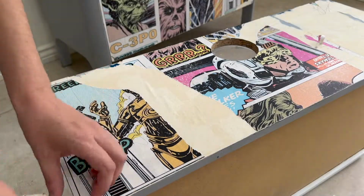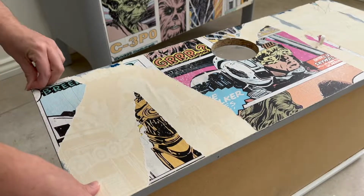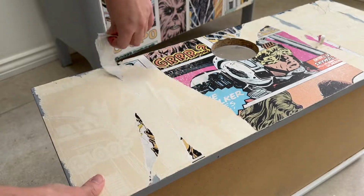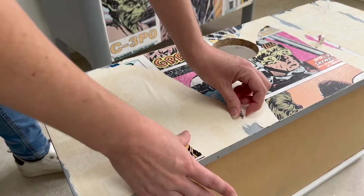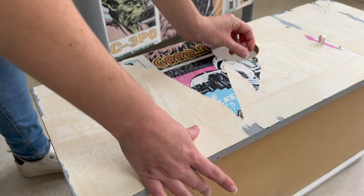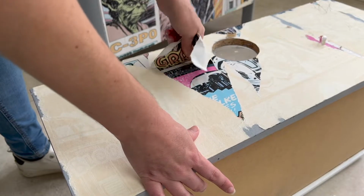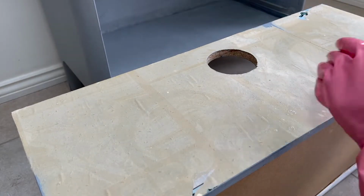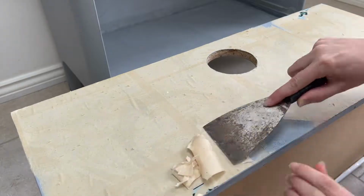Fortunately, the piece didn't need too much of a clean to make it suitable to start from, but I did need to remove the wallpaper properly so I could start with a clean slate on those laminate drawers. The top part of the wallpaper peeled off quite easily. That's the piece with the image printed on it, and it just left that bottom layer of the wallpaper to remove. So I used some warm soapy water and a scraper tool, and it came away quite easily.